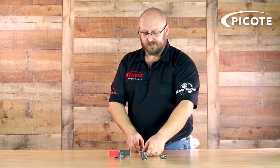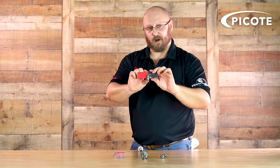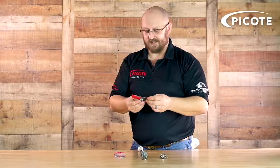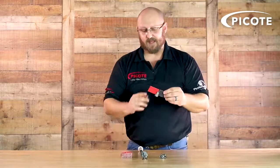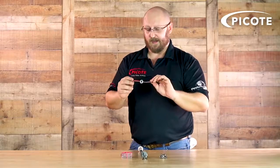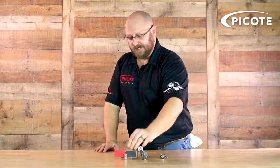In addition to these two cleaning tools, we've also got, of course, our smart cutter head. This is specially designed. It's smaller in length, it's shorter in length so that it can navigate through bends easier. It comes with a pack of 10 side grinding panels, so you have several to last you quite some time. These can actually be cut and adjusted as per pipe size as required, and gives a really great finish inside the pipe for cleaning small diameter drains. So that's our cleaning package that's included with the mini cleaner.